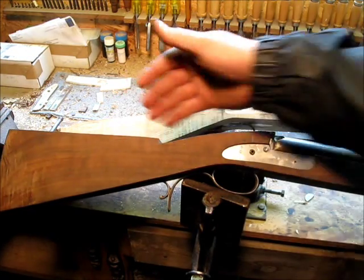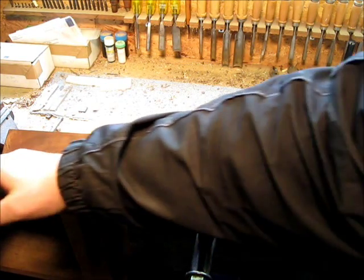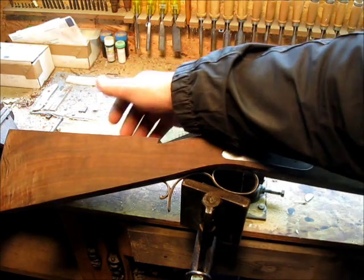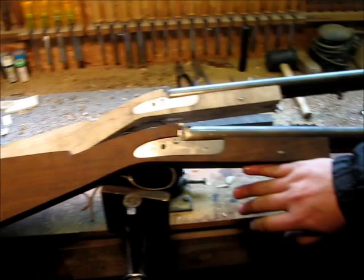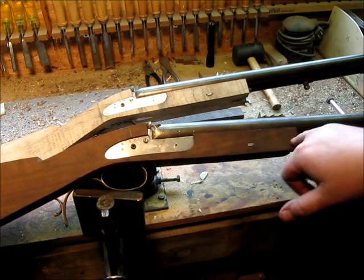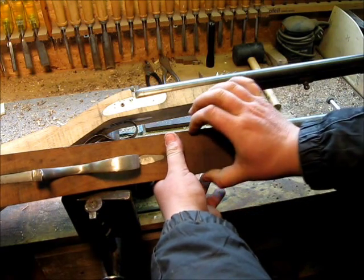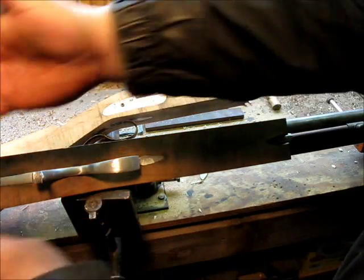It's really simple. Once I get this panel area done and roughly shaped out, I work in basically quadrants. I'll take from my reference line to the midpoint and shape it down that way. On the other side, of course, where the cheek piece will go on this right-handed one, I'll lay out my cheek piece, remove the wood around it, and then work from the reference line down and from the reference line up to the cheek piece. It's basically the same deal up here on the forearm. I'll take this off to where it matches the contour for the entry pipe and clears where the escutcheons are going to be, and then shape it from the entry pipe back to the panel to get it narrowed down to the wedge shape, then work on rounding it over going from center line each direction — basically working it in quadrants in each area.